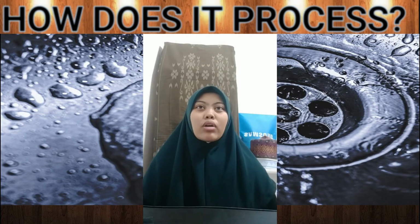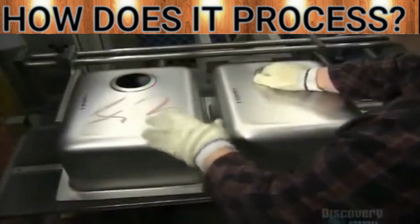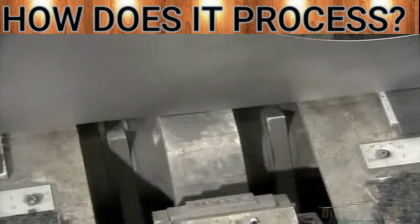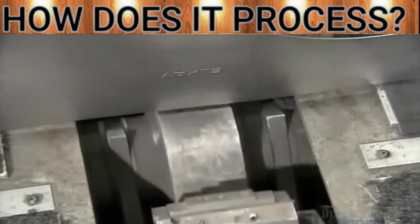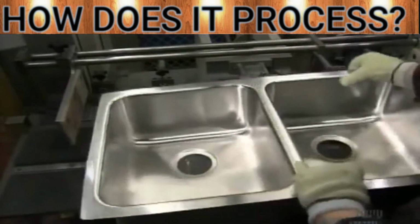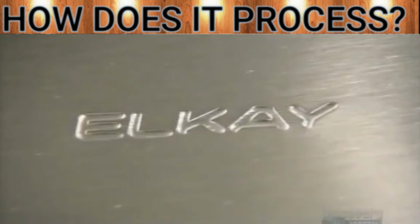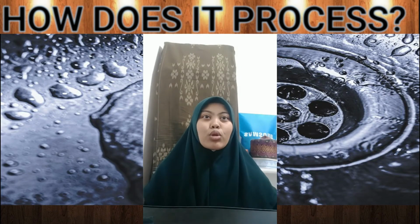I will present about finishing, which is first stamping the logo. We use acid etching to customize metal products. It has an interesting artistic effect. This is due to the acid's ability to eat away the metal. This process of metal acid etching is to fix a design or picture on a piece of metal with heat fuse ink and submerging the metal in an acid bath. No special tools are needed, but it produces a professional brand look on a metal product.